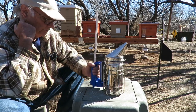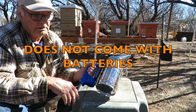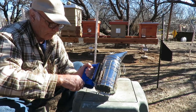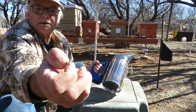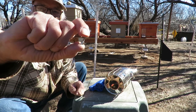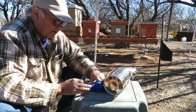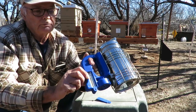The battery compartment is in here. This runs off of four AA batteries — you can use alkaline batteries, or as I'm going to be using, some nickel metal hydride rechargeable batteries. Now this little screw here is very, very small, and I think you could easily lose this screw. I'm not sure what the thread size is, but it's pretty small — probably a 6-32 screw — so I'm going to see if I can find some spares. This holds the cover on, and in here I've got the four AA rechargeable batteries.